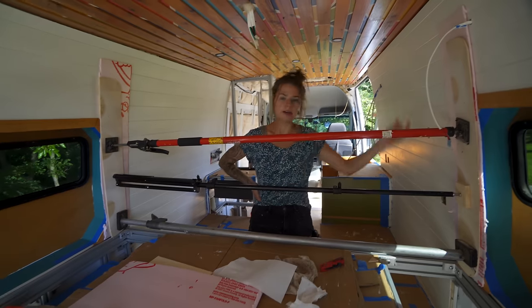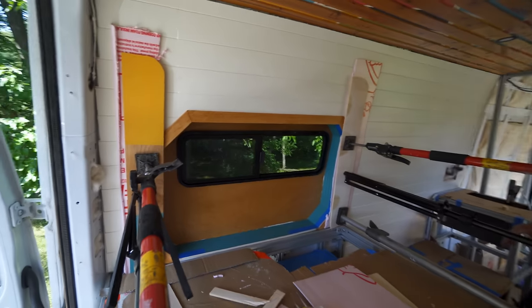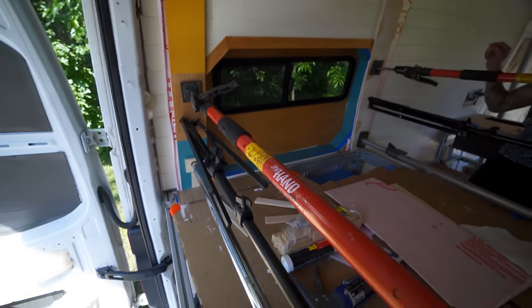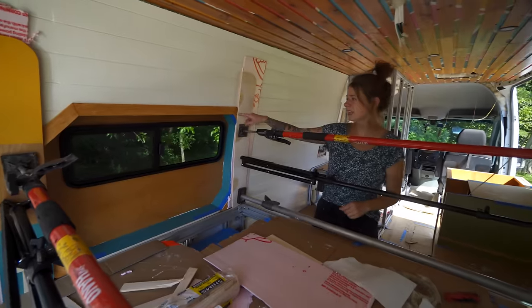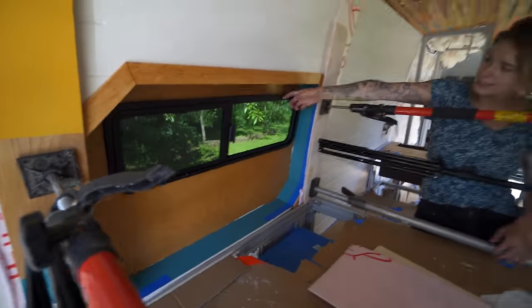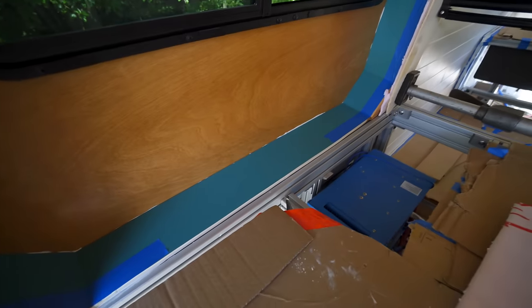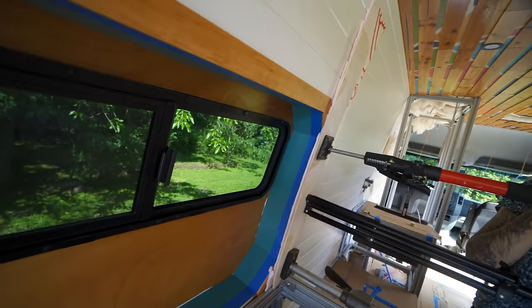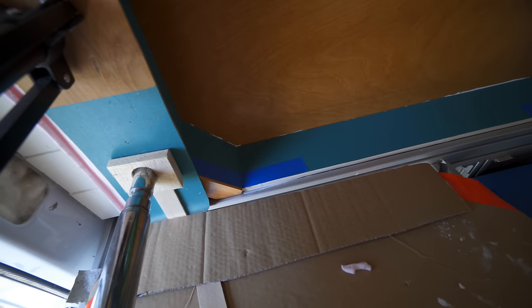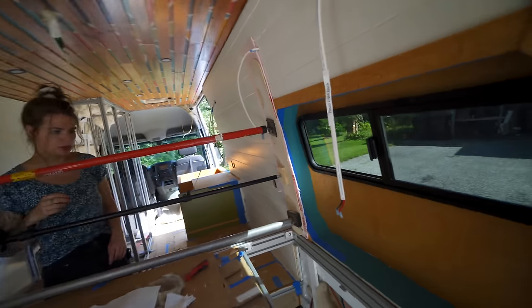All right, so we installed our trim ring, now as we're sweating to death. These are our trim rings. We went ahead and goosed up with marine adhesive the backside of all of these trim pieces, as well as the backside of this guy. The edges, you can see it kind of coming out on the sides there. It appears to be easier to clean when dry, so we'll come back and straight blade it, cut it out.